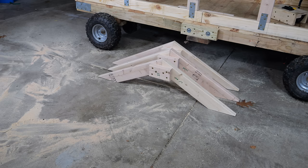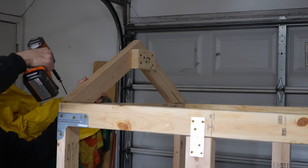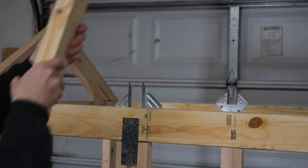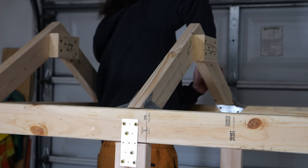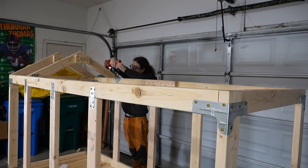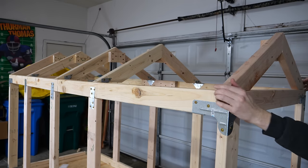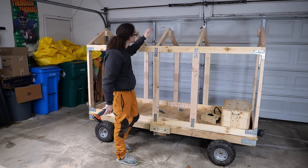After a little while working, we had all of our other pieces of the rafters made, so it's time to install them on the rest of the frame. I go ahead and lay one on the corner and put in some large screws to hold it in place. Then I take some of these metal brackets called hurricane ties and I line them up where I want each of the other rafters to be, putting in some screws to hold them in place. I step inside and take some pliers and bend down the hurricane ties so they line up with the 2x4s, then go around with some big screws through the rafter itself and a couple through the hurricane ties as well. Since the rafters on the corners don't have space for a hurricane tie, I put in a large screw. Then I take some of those metal brackets and I attach them to the frame of the base for both sides, and this thing's really starting to look like a little structure.